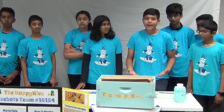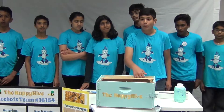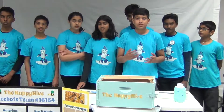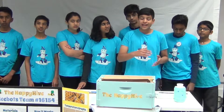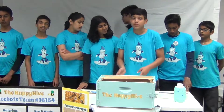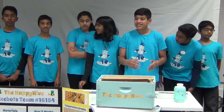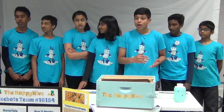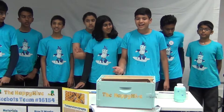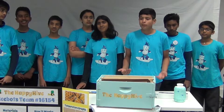Right now, if a beekeeper wants to check up on the bees or get honey, they have to go through this tedious process of smoking. In an effort to solve this, we've implemented a monitoring system which contains a temperature sensor and a microphone. The temperature sensor measures the ambient temperature of the hive, which is then compared with a graph of real-life data from a healthy beehive, and sends that data back to the beekeeper so they can check on their smartphone or laptop whether the hive is doing well. The microphone takes the audio from the bees and compares it to certain sound signatures that occur when the bees do something in the hive. For example, if the queen bee flies out of the hive, there will be a unique sound from the bees. These sound signatures tell the beekeeper exactly what is going on and will show up on their smartphone.